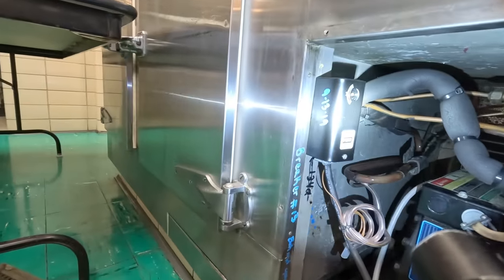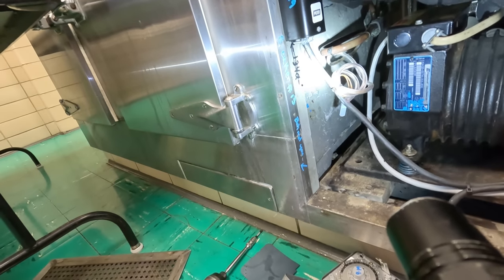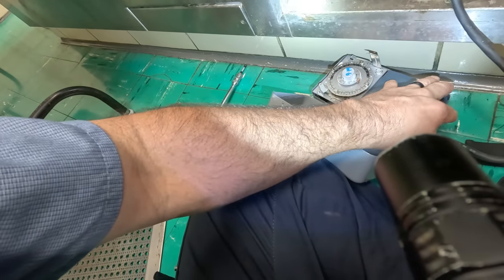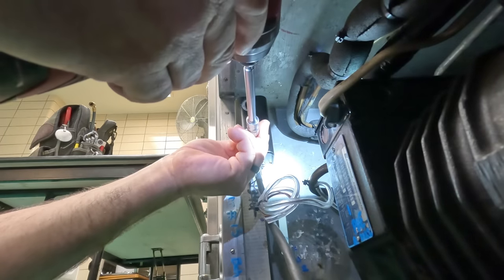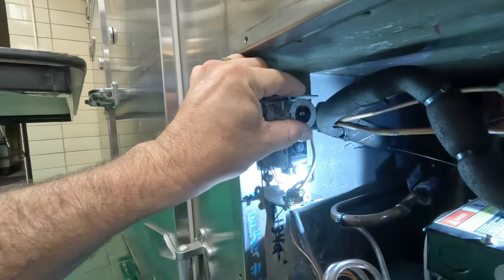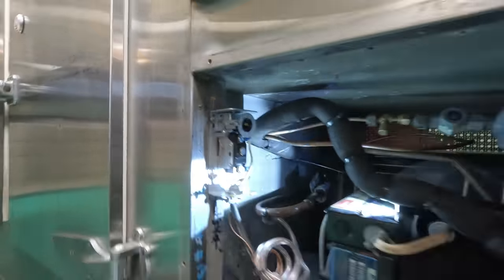From what I'm seeing, depending on what that thermostat is — which it looks like it's at 40 — it's been screwed with. Let's turn it down a little bit, see what it does. It appears to me our issue is the thermostat. Fans have been running nonstop, right at the 40-degree area. Let's take it down to 35 and see how that does. We'll let it run for a bit. We'll go grab a thermometer and see where we're at.